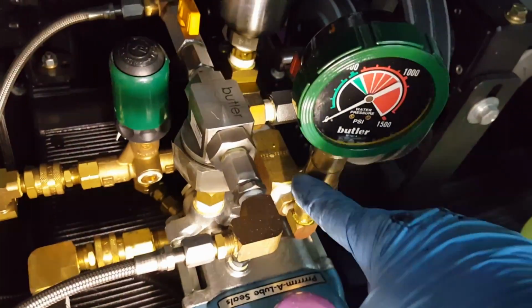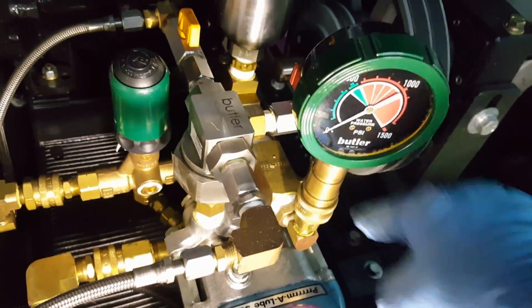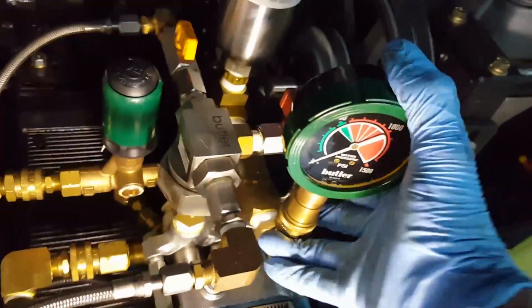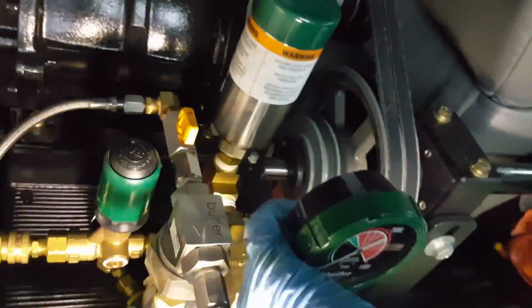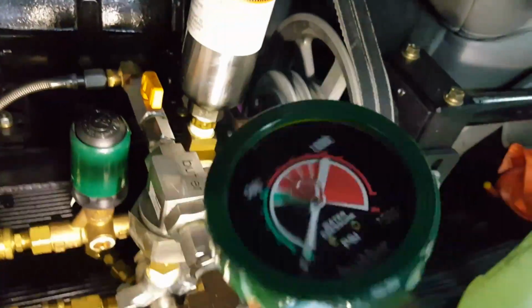this here. You'd have to release the pressure sometimes here. That's the hot water convenience in the front. Release the pressure. This could be buggered up or jammed up with just dirt and debris sometimes, for some of the older ones. I've found that. So it's just a female quick connect on that, and you pull it up and off. So that's in position for your pressure gauge. I'm going to set that over here on the tank.